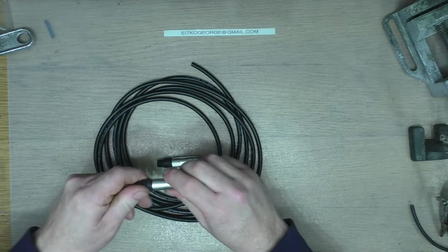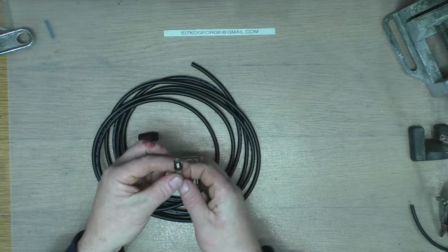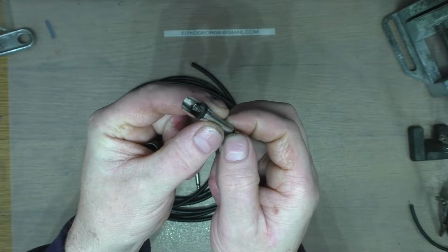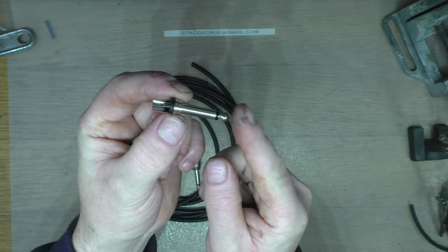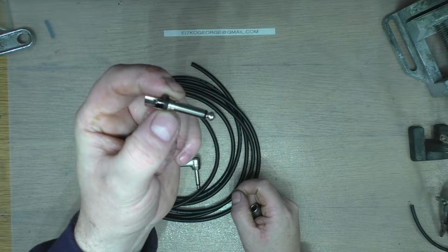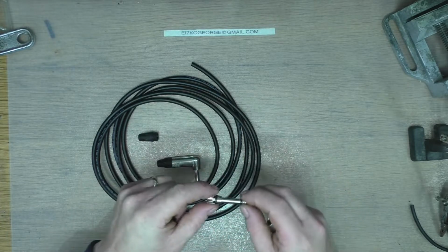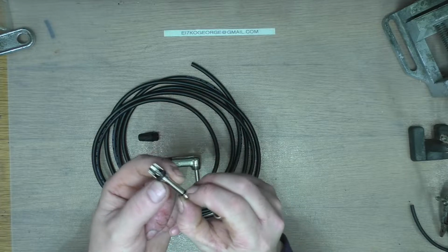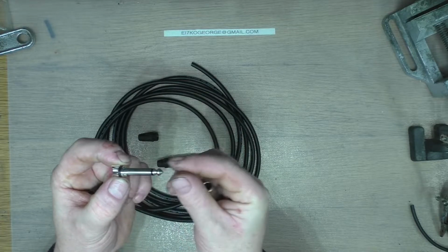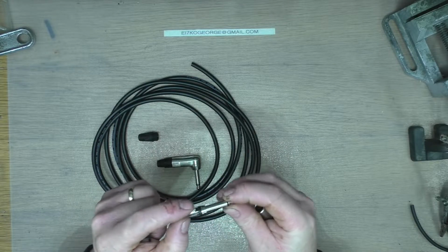And the tab on the back here, let me just take this one apart, where you solder on for the center pin, that's actually the end of the shaft that's going all the way through. It's one piece. Whereas the other plugs aren't. You can see that's the back of the insulator. That black piece there continues up through the middle and comes out here, and then the center pin shaft is going down through it, and this is your ground connection here.